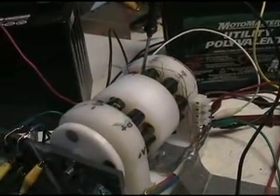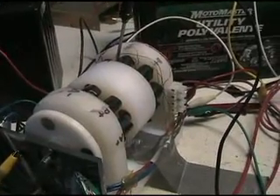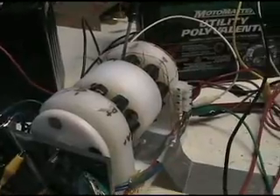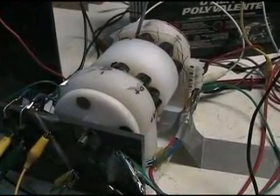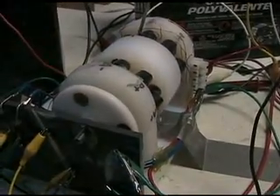The back EMF is being recycled back into the motor. What's happening is the coils are getting very hot — hotter than they normally would with a direct current going through the machine as if the motor was stopped and the switch was on. So there's obviously some extra energy being produced. I'll turn the machine on, let it run for a few minutes, then take some readings. It's around about two to three thousand RPM — 3300 is the top I've had it at.